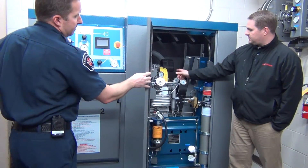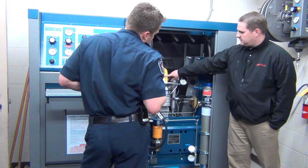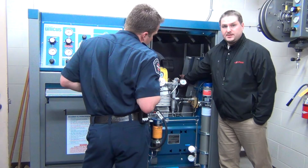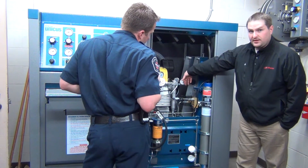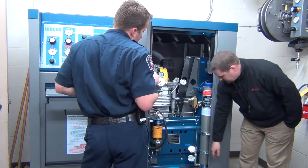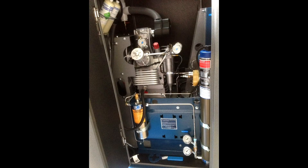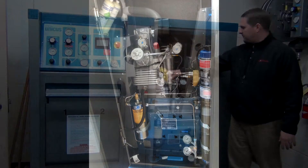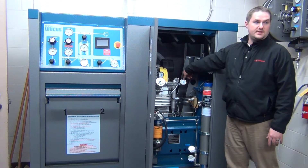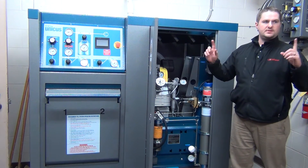At each one of your stages, in between the stages, it'll show your pressure. Notice this one goes up to 200, and then as you go back to your second stage it goes up to 600. Your third stage goes up to 1,500. Your fourth stage goes up to 7,000. The reason you have those is for diagnosis — if there's a problem between your first and second stage, a tech could come over and say we're building up 120 PSI on our first stage but we're not getting to 300 on our second stage, so that's where the problem lies.